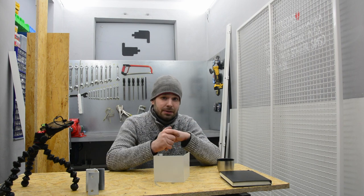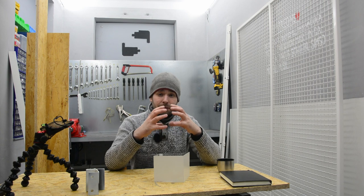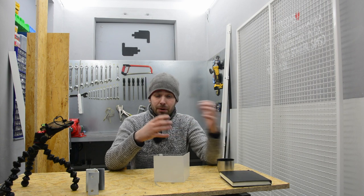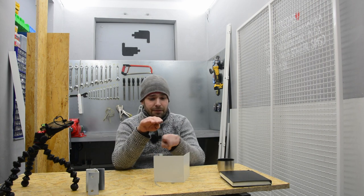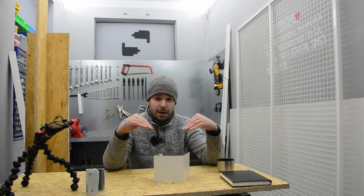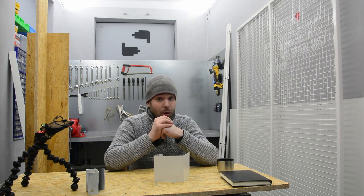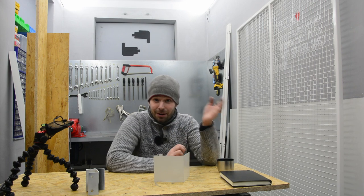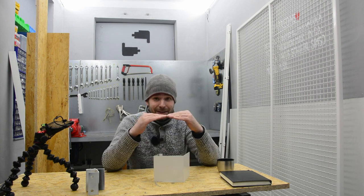And the heat usually expands things, so when you are welding, it expands, but when it's cooling down, it shrinks into a smaller piece than it was before. So I was thinking, okay, I have a bend like this, so if I lay a straight bead from the bottom, once it cools down, it will shrink and move upwards. And boy, I was wrong. I still have to learn quite a lot about this, because what it did, it bent in the other direction.